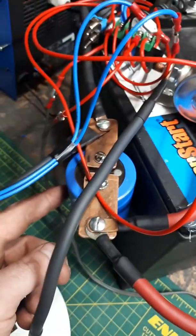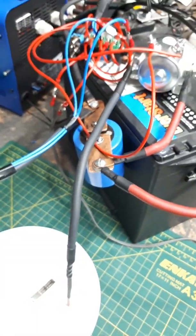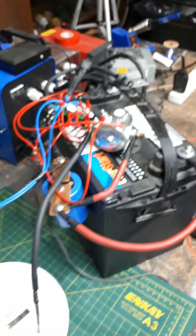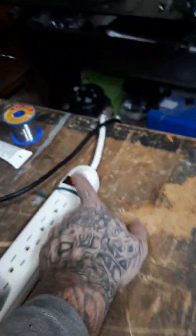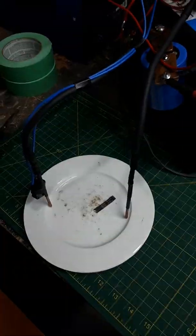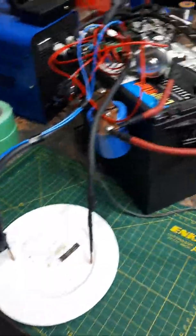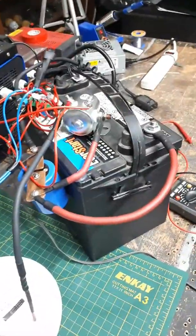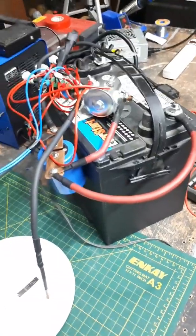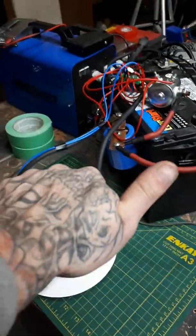The consistency of the weld comes from the buffering of the capacitor — it's an 82,000 µF, 15-volt capacitor. That's it. Best welds you'll get — you can weld 0.3 or 0.4 nickel strip with that, multiple layers, make any e-bike pack you need. What's nice about this is you can hook a trickle charger up to it and keep it fully topped up the whole time. Works great — hope everyone's having a great day, cheers!